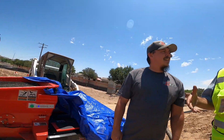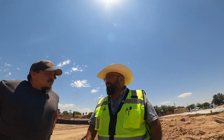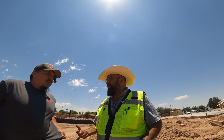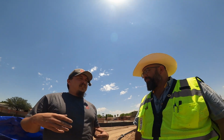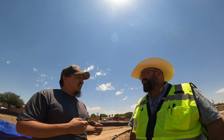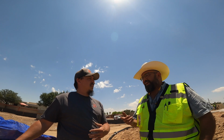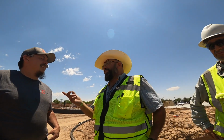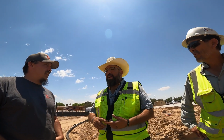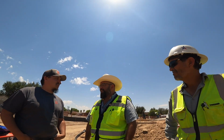But you're not trying to push to a 5 or 6-inch delivery system, or even a 7. Right. Going from a 5 to a 4, there's not a lot of reduction. We have problems with the bigger cylinders. On the bigger pumps, it seems like with the higher pressure they separate, especially if you have manufactured sand or crushed material, they really push the moisture out of the line. Exactly. This doesn't have that higher pressure. And it's also 5 to 4. That's one thing that people don't learn. My dad always said, less pressure ain't more pressure. It ain't good, because it just restricts it. Yeah, you're just trying to shove it through there. Higher wear points.